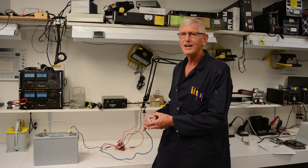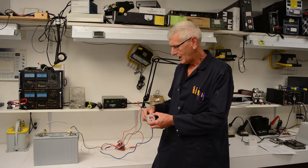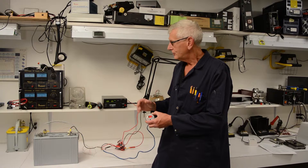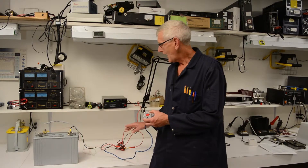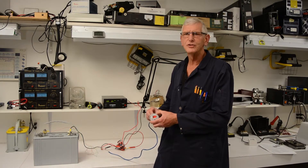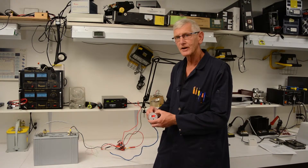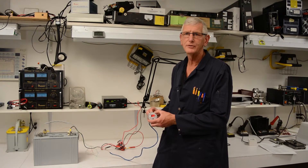The wiring we use is low current — there's basically just a monitoring voltage, so it's low current wiring. I've got some 22 gauge here, some very thin wiring, to the common negative for both my battery systems, and one positive for the battery, and my other positive for the power supply. The wiring itself is very light wire; you could use just about anything — 22 to 24 gauge would be fine. Not a problem at all, any wiring size. All your positive leads should be fused whenever you're hooking up to a battery system.